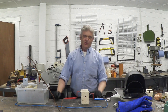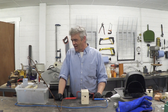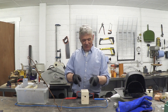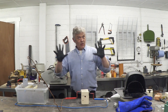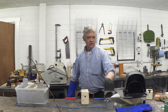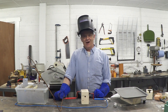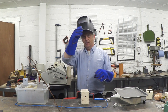Okay, so here it is all set up: our little micro furnace courtesy of King of Random, and our water-bath welder courtesy of some guy in Uganda. All we have to do is turn this on — it's perfectly safe like that. It's now live, and it's perfectly safe as long as we don't bring those two tips close together. When those two bits come close together, a massive amount of current flows. I'm wearing rubber gloves to protect me from that, plus some welder's mitts because it gives out a fair bit of heat. I have my welding mask as well because when we strike that arc, it is bright.